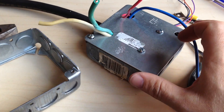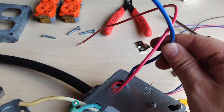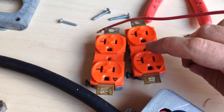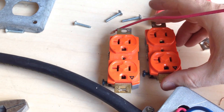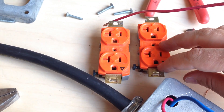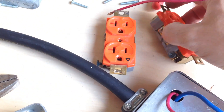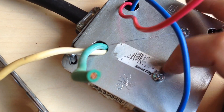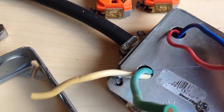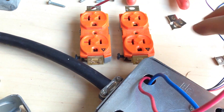This is what it looks like half assembled — the relay-controlled parts are in the bottom. Hot for the relay is under here, and then these are the two relay-controlled outputs. These are ground and neutral, and these are my outlets that I'm going to wire up next. These are isolated ground outlets, which means the chassis is not grounded to ground — normally used in hospital or audio-visual applications with sensitive grounds. We have no conduit here, so this box is just not going to be grounded through the chassis. These are more expensive outlets, but it's just what I happen to have.